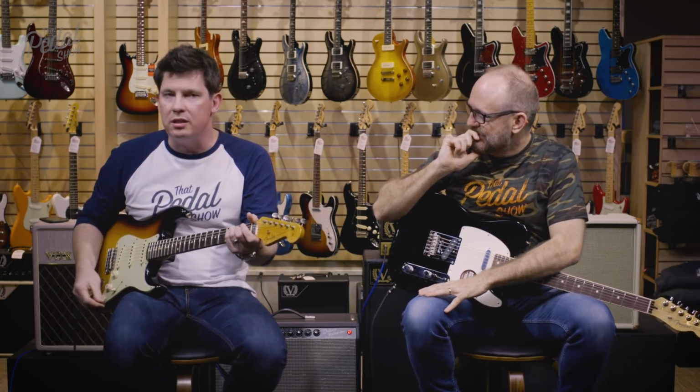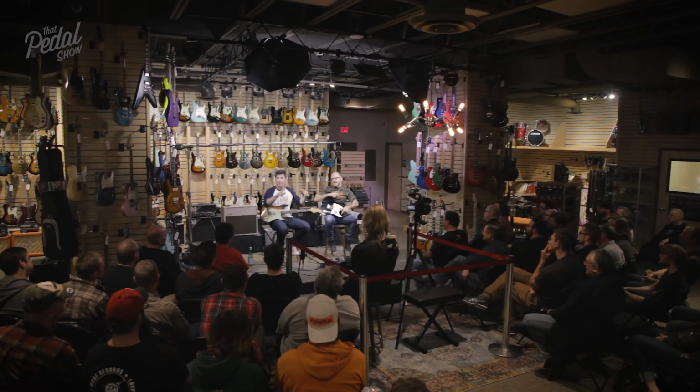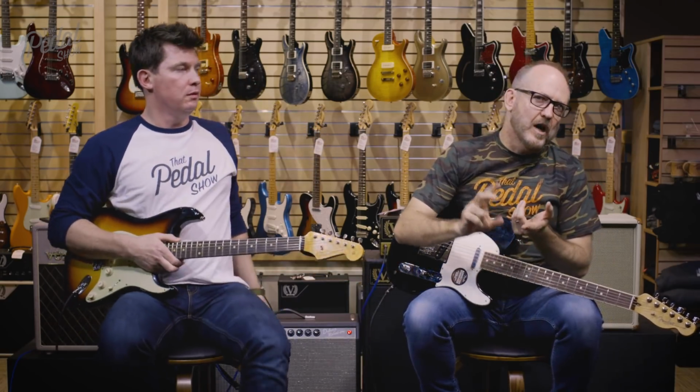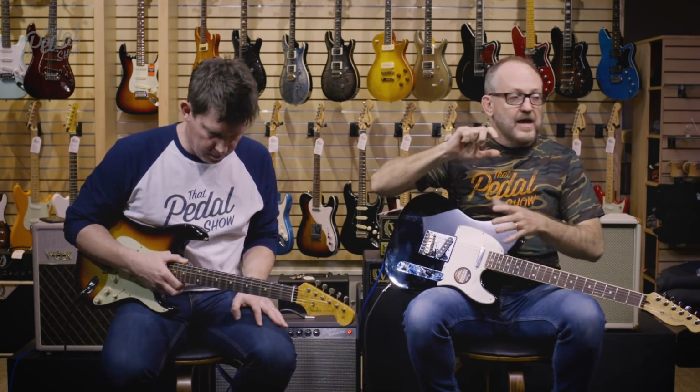Right, you've got a pedal board, a whole bunch of pedals together. Each foot switch, each patch cable, then the cable going back to the amplifier, that's all added capacitance. A buffer will drive that capacitance so it can make a very dull sound nice and bright. Has anyone experienced plugging a bunch of pedals into your amp, you play your guitar and you go, where's all the high end gone? Anyone experienced that? Yep. Okay. That's what Dan's talking about. So pedals like Ibanez pedals and Boss pedals, those pedals that we grew up with, they all have buffers in them. And the buffer is on when the pedal is bypassed.